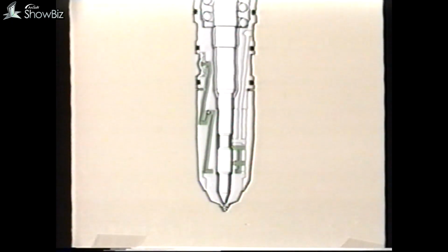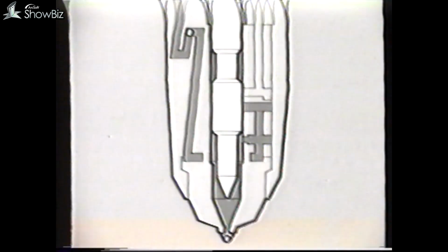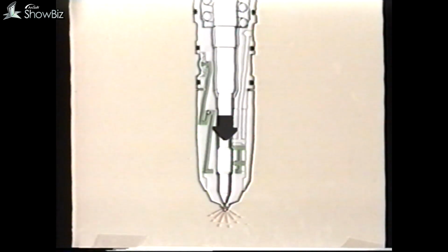the engine. If the pushrod is slack, this will cause overfueling with black smoke, because the injector, when collecting fuel prior to injection, will be in the fueling position longer than normal and collect more fuel. This condition is known as set long, and in addition, the cam nose crush will not be effective, and the injector will carbon up over a period, resulting in a misfire and causing damage to the cup.